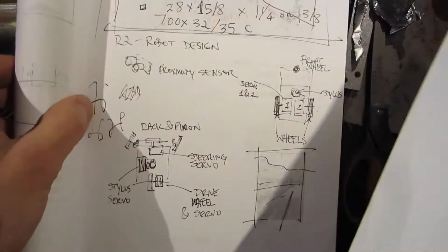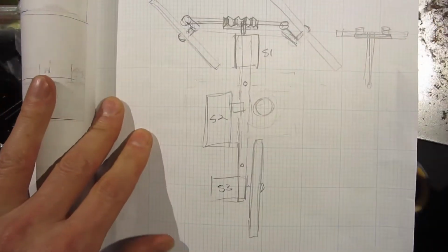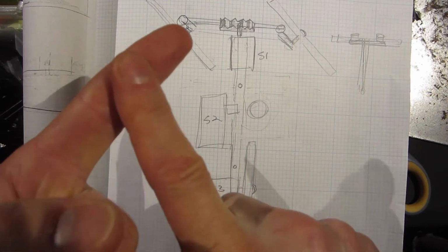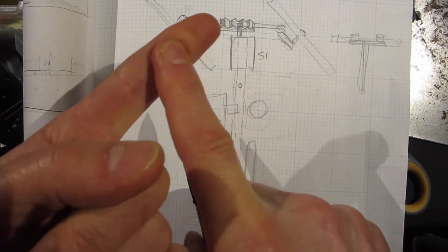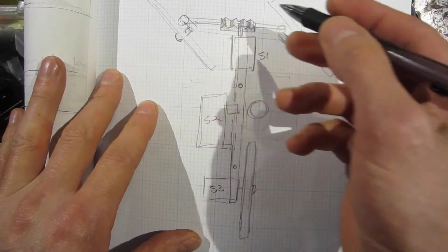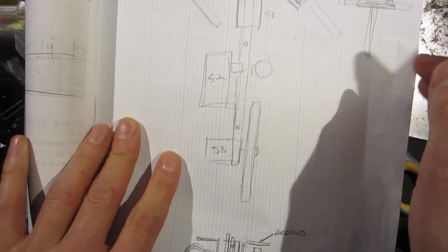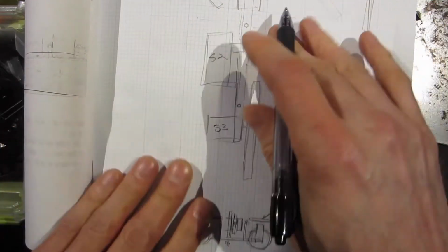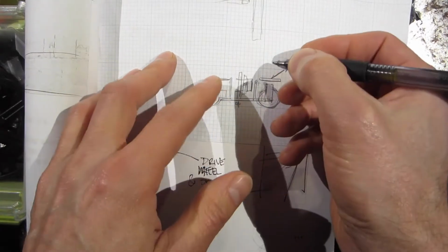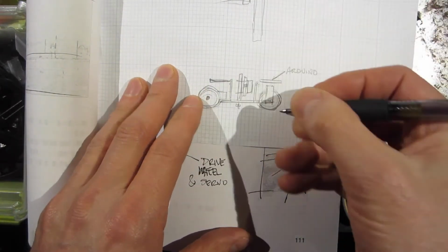So, doing this robot build-out, I've decided that a rack and pinion steering situation is both doable. It shouldn't take more than, I reckon, a day to figure out with the parts that I have. So that would be 1 servo controlling the rack and pinion. Next up, by the way, we're doing kind of a T-shaped chassis, rigid. And then off of that, there'll be spars and whatnot, standoffs to mount things like the Arduino or 2 Arduinos. Might have to stack a couple of them.